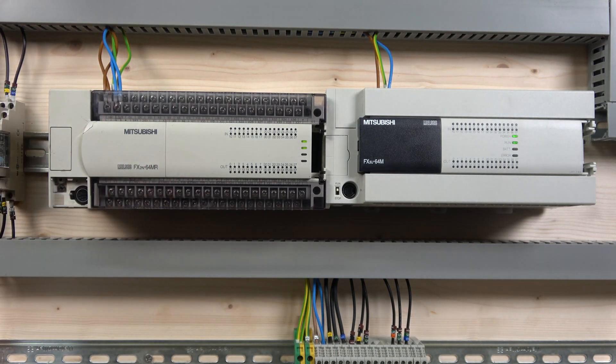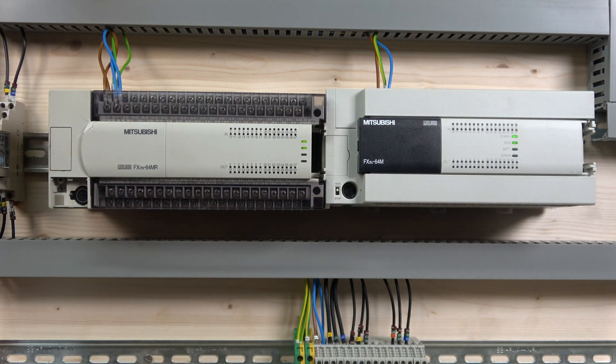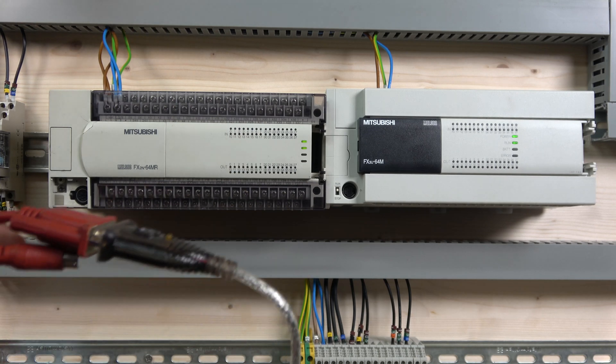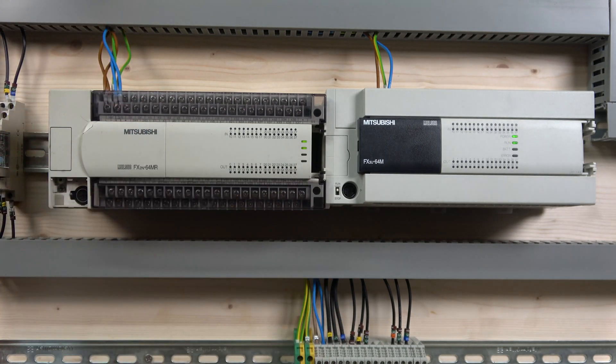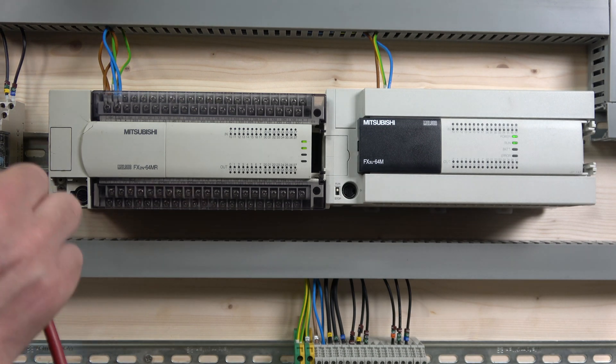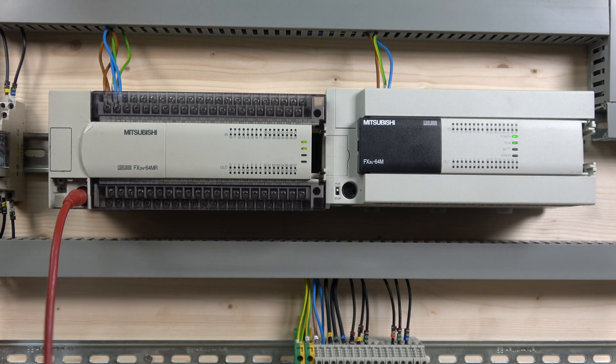This PLC has been off the machine for quite some time so the battery most likely just died sitting on the side. As mentioned at the beginning, we're going to be using an SC09 cable. My SC09 cable has an RS232 port and I'm using a USB converter — I will leave details in the description below. This is a Mitsubishi-approved converter, and there is a video in the description on how to install the driver to get this cable going. We're going to create a small test project on the FX2N PLC, then transfer it onto the FX3U and compare.